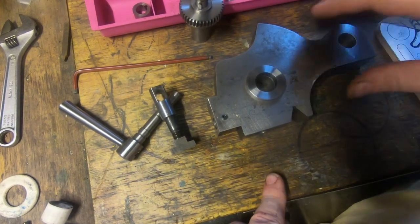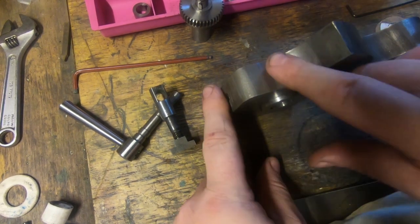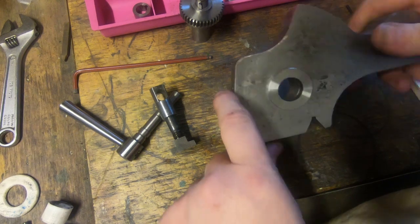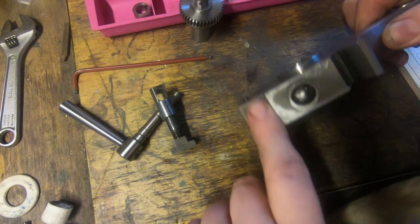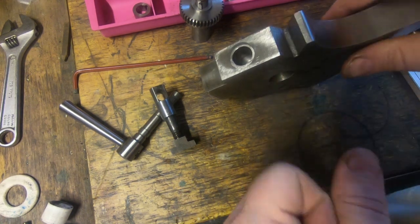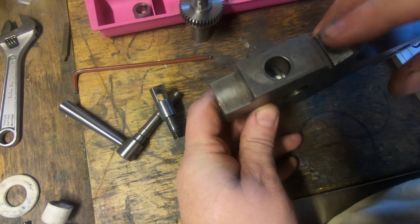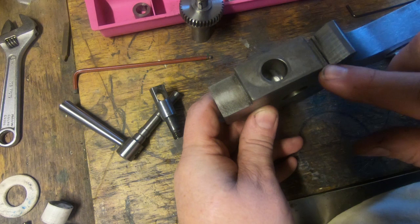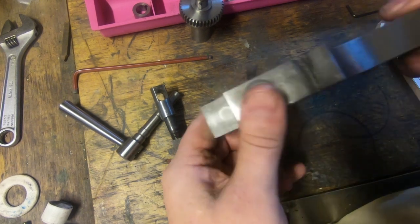This plate was wire cut by Marcus Wilson, JB from Oz on YouTube, and ZDM wire cut. It's really a pretty nice thing. It was very, very close to what fits the bed. I ended up milling about 0.8 of a millimetre out of it all over, so that this sat down properly. But apart from that, it's a pretty good fit.